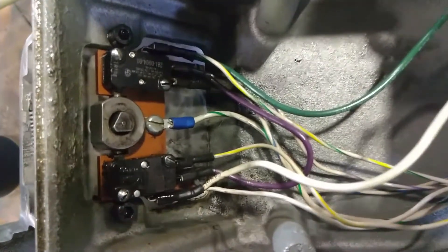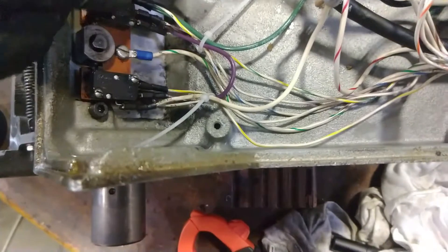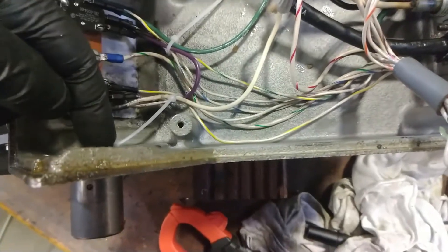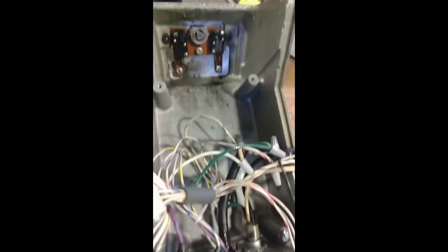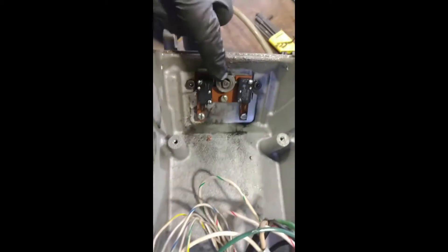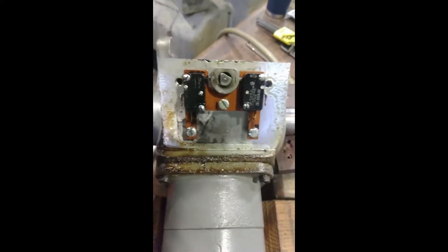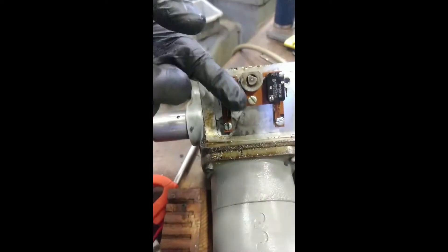First thing is to take a photograph of that so we know where the colors go. We also do a wiring diagram indicating the colors. I also like to put a couple of zip ties on here to group the two halves — right side and left side, one points right, one points left — just a little extra insurance. Now that all the wires are disconnected, we take these two screws out, separate the wiring box from the gearbox, and get better access to the switch panel.